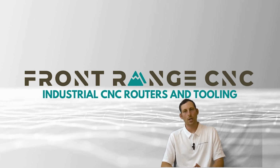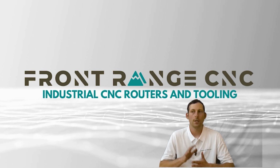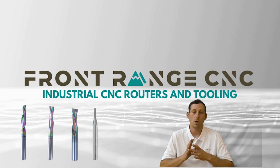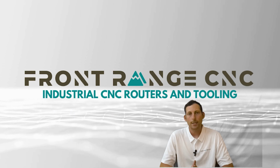So there's really, say, five main styles of tools that you'll see in the router industry. And this would cover the majority of materials from composite to aluminum to wood, plastic, foam. The main five styles you'll see will be an up flute, a down flute, a compression, a straight bit, and an O flute. And these are going to be the most common styles that you'll see out there. And they're each good at different things. And there is overlap between the different styles, but generally they are good for different applications and especially different materials.